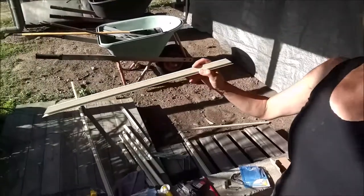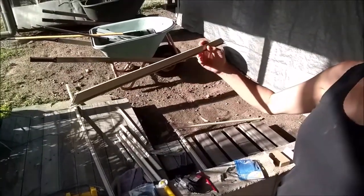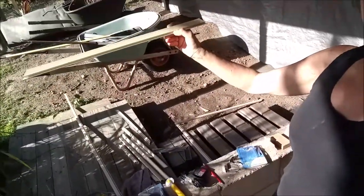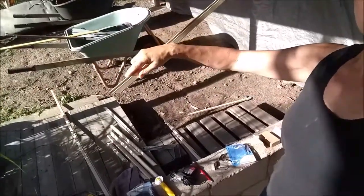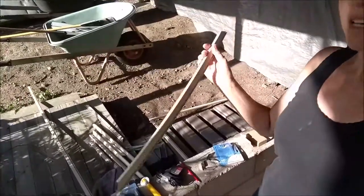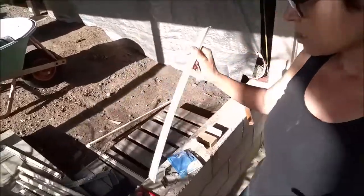The second mistake I made: here it looks as though I've done a nice cut so the angles meet each other like they would sit in a corner, but see this channel here at the bottom where my thumb is — that has to be on the inside. So even though I've got the right length and I cut nice 45-degree angles, I've still got my angles wrong. Eventually I got that right.